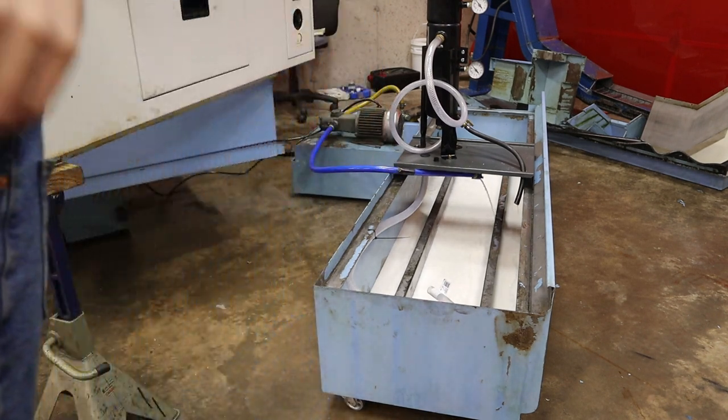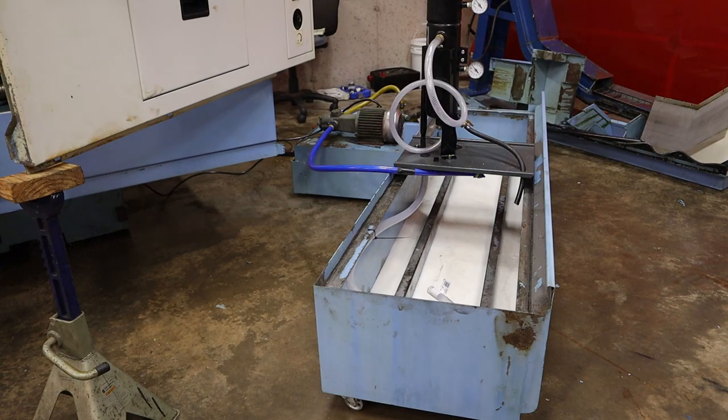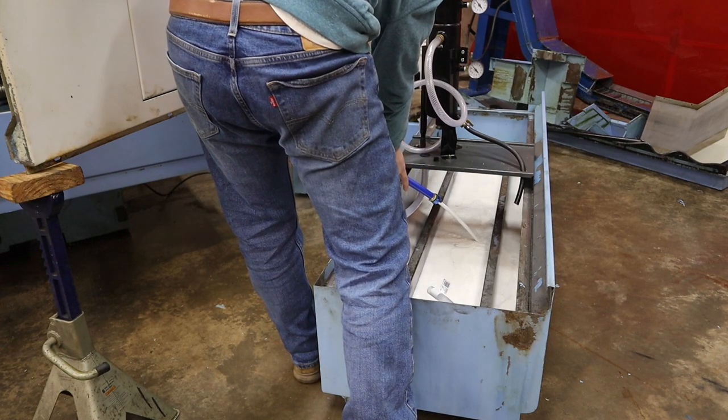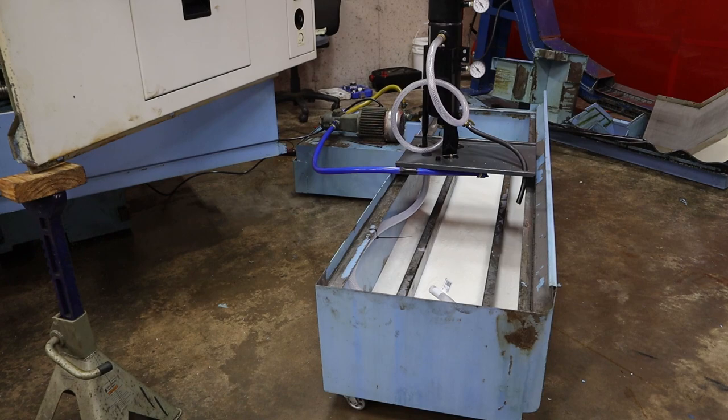Pump performance seems lackluster. I wonder if that's just how much fluid it'll flow. I mean, if it dropped a leg, would it even spin? It doesn't sound that good either. No, the internet says it won't even start if it's missing a phase, so that makes sense. So seeing as I can start and stop it pretty readily, and it is actually flowing coolant, my guess is it's spinning the correct way. But it doesn't sound that good, but it is an old pump, so maybe it's okay. I'm going to hook it up to the filter and let it run, and if it catches on fire, then, well, something was wrong.